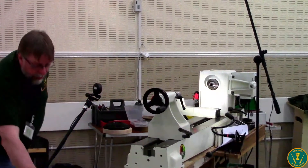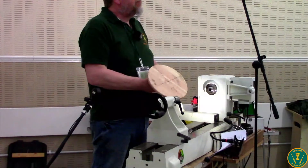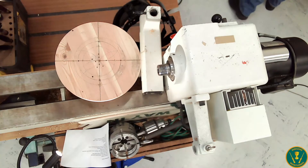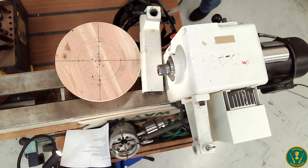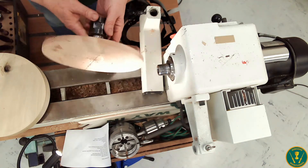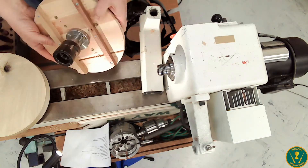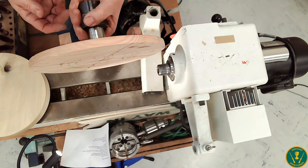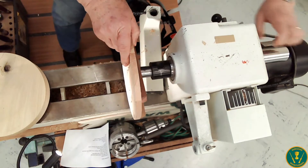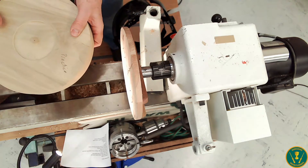How do I go about doing one? Well, the turning isn't particularly magical. I just wanted to show you something I do use — if you've got a lot of gnarly wood, I just use a face plate. It's a rubbish face plate — a piece of kitchen door that warped, so I stuck a few bits of wood on the back to make it flat. Screw through it. It means you can shove that on your headstock and the first thing you need to do is turn tenons and mortises.